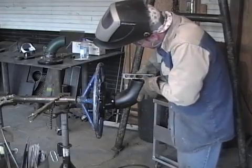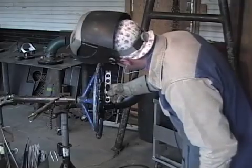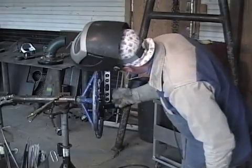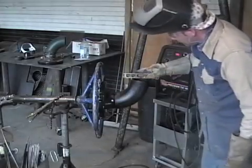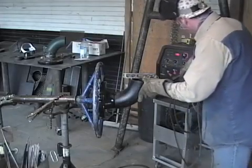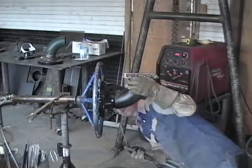According to this, it's got to go down just a bit. I don't think I leveled my flange — the flange is off a little bit at the face, so I've got to come up. That's the beauty of the jack stand: you can raise it, lower it. That's perfect right there according to my level. That's got to go down just a touch, so I'm going to apply a little pressure on there as I go underneath and secure my piece with another tack.